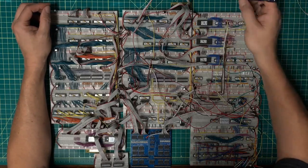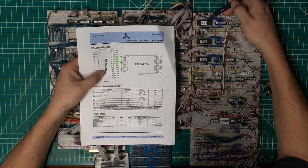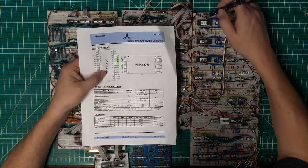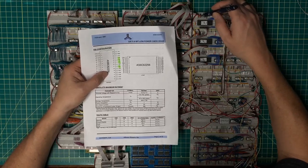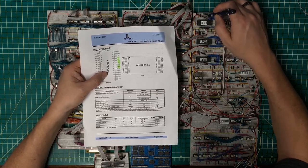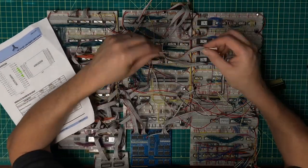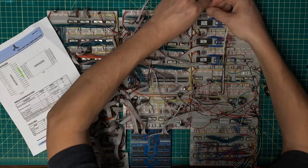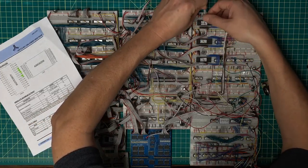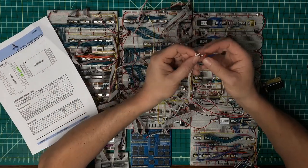It's not quite as easy as I'd like. Chip enable is just to the left of bit 7 of the data — that stays where it is. Then I've got bit 10, then output enable which is tied low — that stays. The next three are bits 11, 9, and 8. So there are 4 of these 6 lines which are going to be replaced with pins. I've got a little contraption that I've made up, which will plug in and drag over where I hook up each of the individual lines for the address bus lookup.